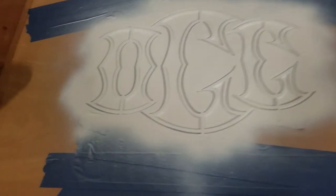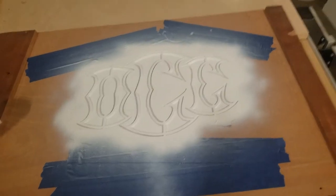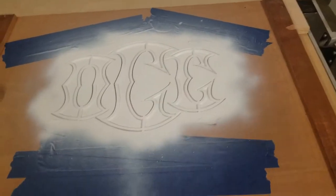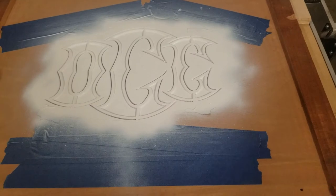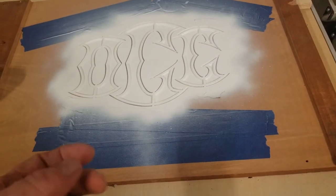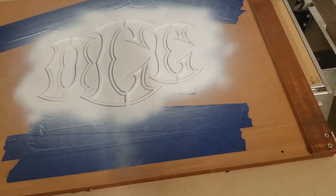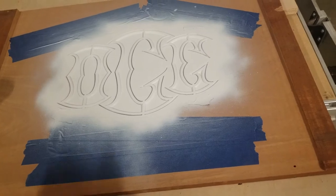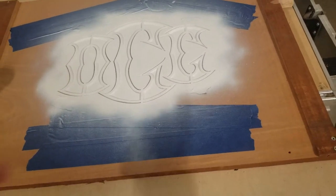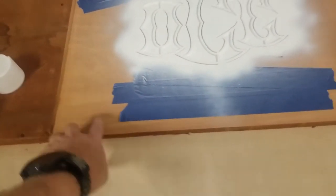Because the detail lines are so small, you have to spray at an angle to get the paint down into them. Ideally for a paying customer, you'd use a white resin — there are all kinds of Mixol pigments you can add to clear epoxy resin — slap in white resin, then surface the material again. A quick sanding took about two minutes.